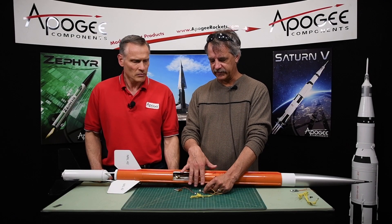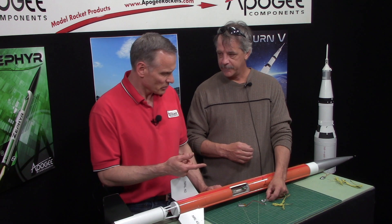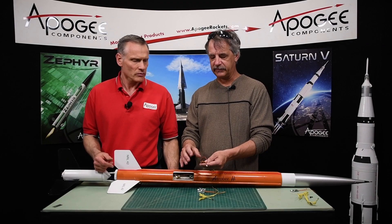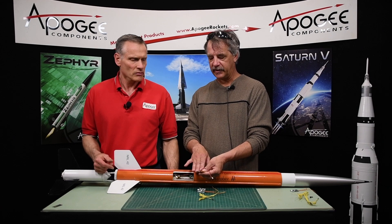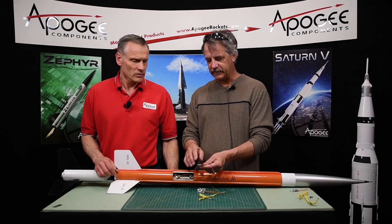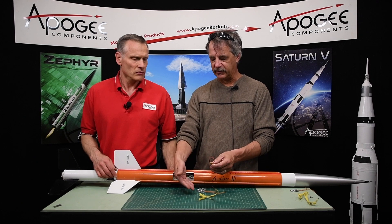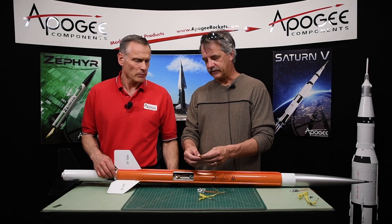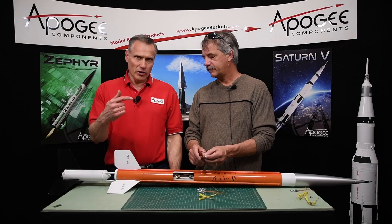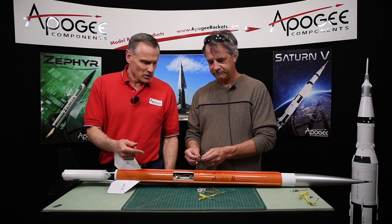A lot of earlier generation timers only output a one-second pulse, but some igniters are harder to ignite so this one uses a two-second pulse. For the battery, you can use a single cell lithium polymer but you need to ground test it - a small 400 milliamp-hour battery may require removing the protection board. A bigger lithium-ion cell around 1000 milliamp-hours can be used with the board in. You can also hook up a 9-volt battery, a 5-volt nickel metal hydride - anything between 3.6 and 15 volts. Batteries without boards are available from Apogee Components.